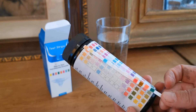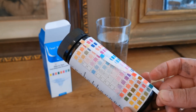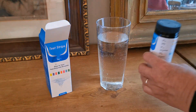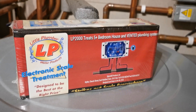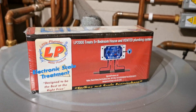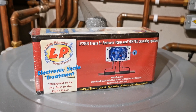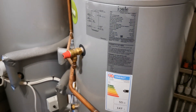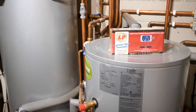You can see that third pad is right into the scale — that brown color. Our pH is coming out at around 7.6; total alkalinity is also very high on this water. But it's the hardness we're looking at, and the match there — the first one in the red — tallies up with about 125 on here. This water is full of calcium carbonate — chalk basically — that's dissolved into it. The purpose of fitting this kit is to take that out of solution in the actual pipes, forming a precipitant whitish powder that washes out with the water, stopping it forming within the pipework and within the boiler.